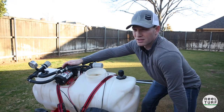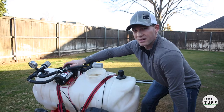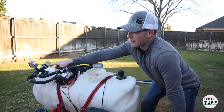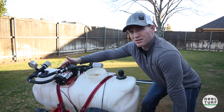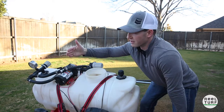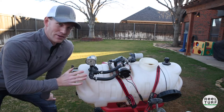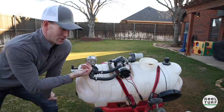That's why I often spray at 40 — it can't run at its max of 60. So I know I should be getting 60 psi on this pump. What I showed you a minute ago on this pressure regulator is that as it sucks water through and I increase the pressure on the backflow valve, it will not stay or maintain above 30 to 35 psi. That's when I began to question whether something was wrong with my pump. But I found a way to prove that theory — we can prove that the pump works and also that the inside of the backflow regulator is working like it's supposed to.